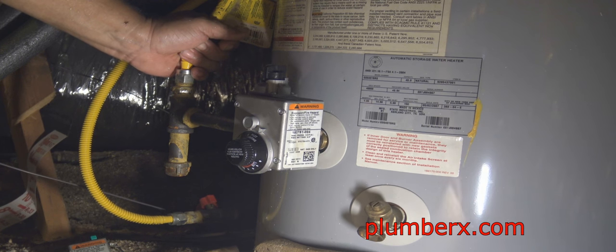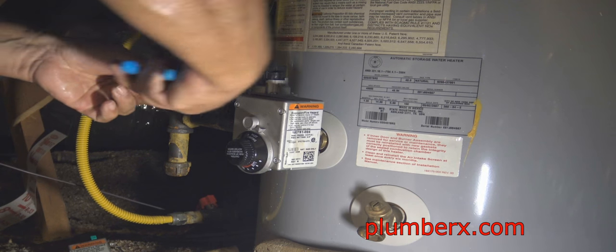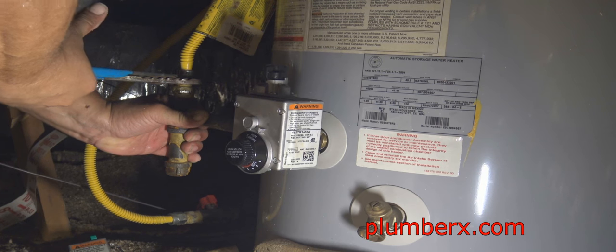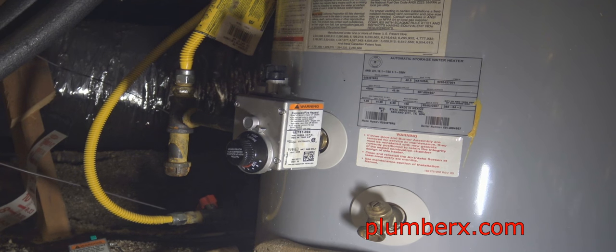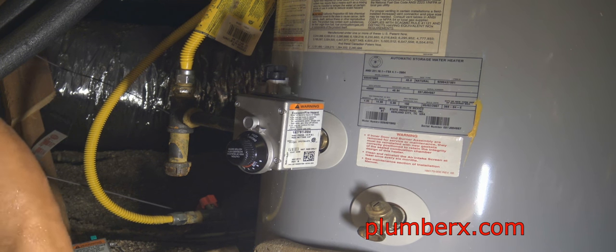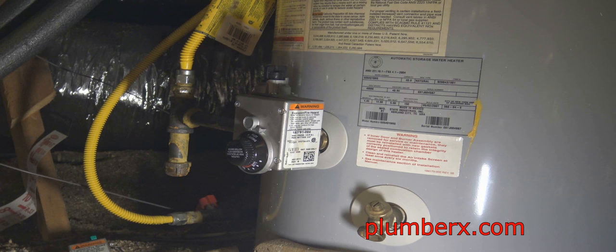Well, you see right here, I'm going to use my channel lock pliers to tighten the gas flex line down. But what you don't see, I wasn't able to show you, is I did use backup, another wrench to hold it steady to really get it tight and sealed. Again, like I said, I'm working in such a tight area.